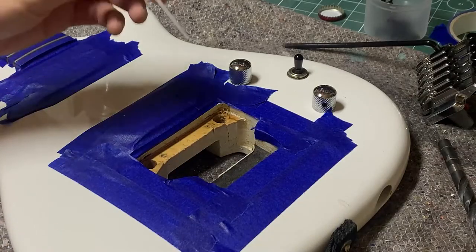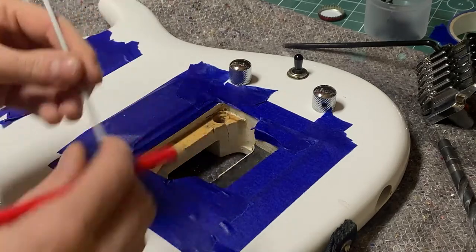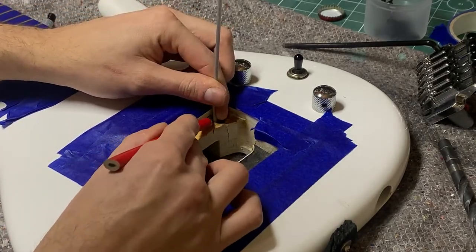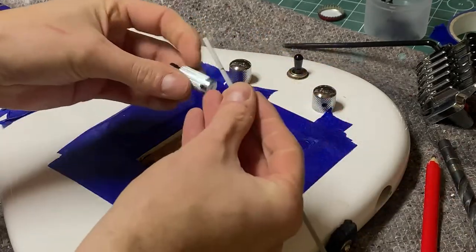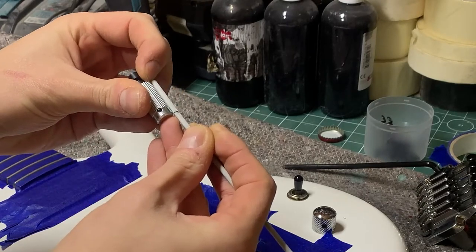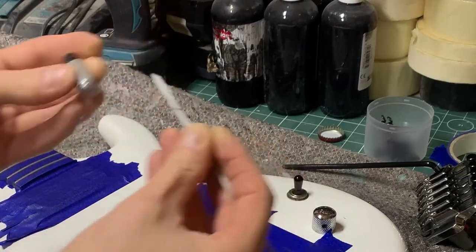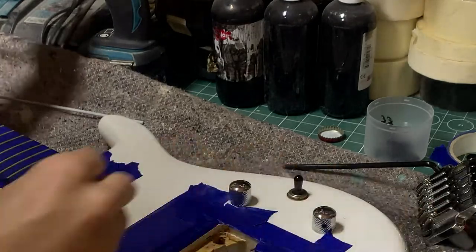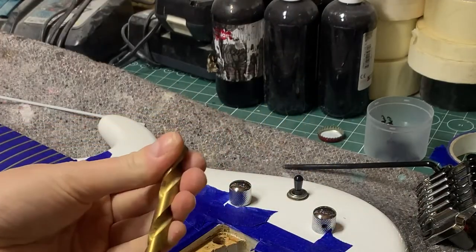What I want to do first is measure the depth of these holes so we're not going too deep. I've just got this little cane here and put that into where it is at the minute. Let's just do a little comparison on that depth to what we need to drill — they should be bang on, absolutely spot on. So that's good, that means we know the depth and we can use that. We just need to transpose that onto the drill bit now with a bit of tape.